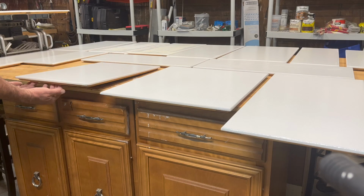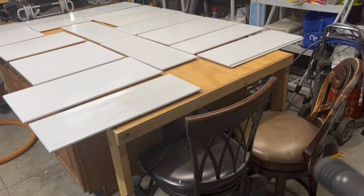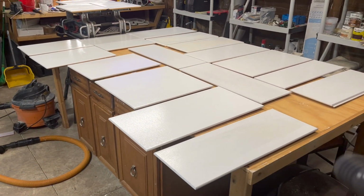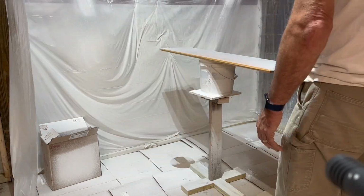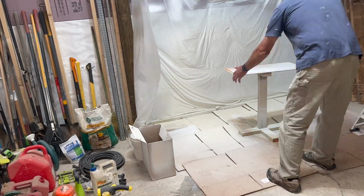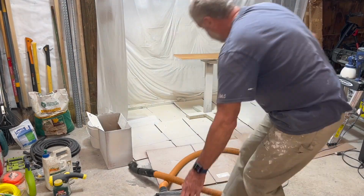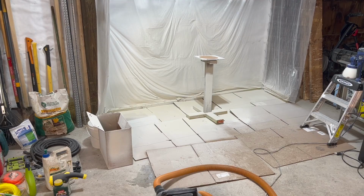And again, same thing here. I'll have to use hole filler on the nail and pull holes again. So it just works out well to prime them, identify which holes need to be hit again, and do it again. I need to prime everything twice anyway, so no problem there. Those are the long pantry doors. So now I've put down my towels to protect the finished surface, and just priming the other side of the doors. Same process, sand them smooth, the filler that is, vacuum them, and spray away. But that little spray center with the stand really works out well.